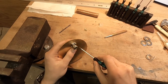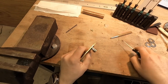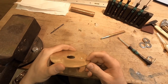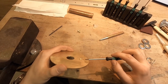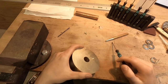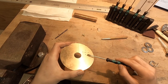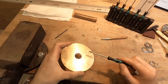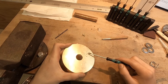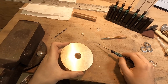For this project it is necessary that the screw heads don't protrude on the back side — that is the side between the reflector and the patch — so we have to grind these screws down. I am going to use an electric powered angle grinder for this, but you can also use a file.